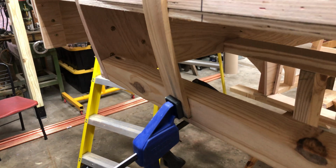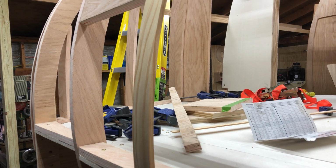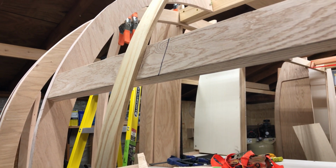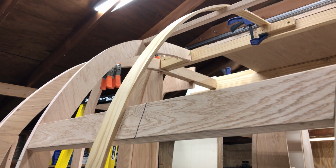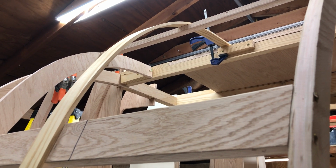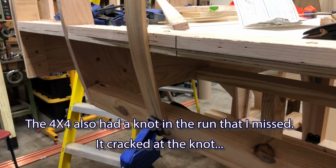So this is the second piece of wood that I steamed. The first piece of wood that I steamed was a 1/2 inch slice off of a 4x4. This piece is a 1.5 inch piece off of the Southern Yellow Pine, which was not kiln dried. Pretty much have discovered that kiln dried wood is a no-go. Doesn't really want to take steam very well.